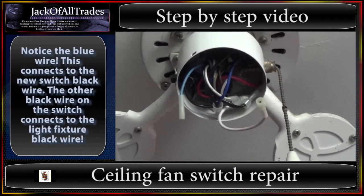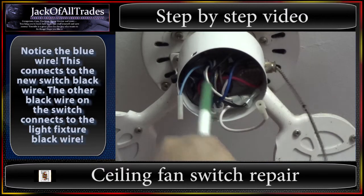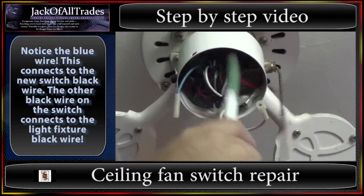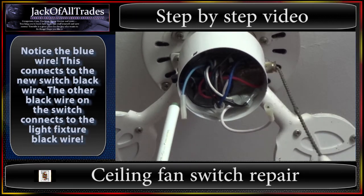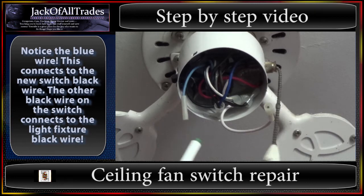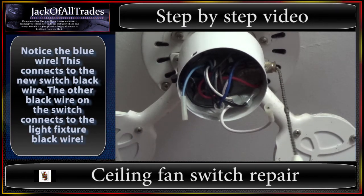Now back in my daughter's room — I took the lights off the bottom. You don't need to see this, but there's a screw here, a screw here, and a screw here. It just comes down. You're going to have two wires coming to the switch. There's going to be one coming down that's going to turn on and off your device. This blue wire — it could be black, whatever — it's the positive. The white is the negative ground. So when you hook up your switch, make sure that it's in the positive line only. The switch will connect here, the new switch, and then the black will come out and go over to the light assembly, and this wire will connect directly to the white wire on the light assembly to complete the circuit.